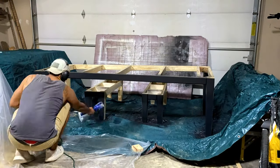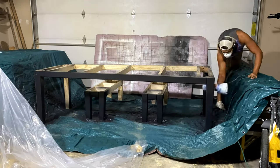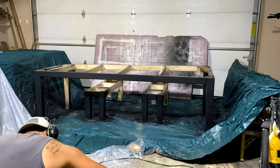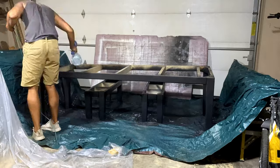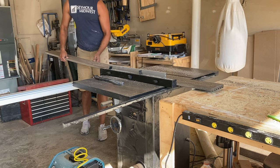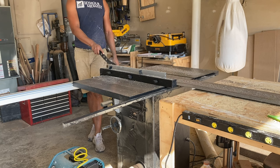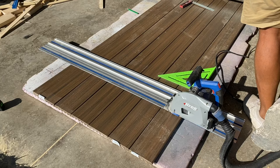We decided to go with a black exterior-rated paint for the base of both the benches and the table. I was a little concerned while milling the lumber — since this is treated lumber, the treatment only penetrates so deep, and I wasn't sure I was removing all of that treated protection as I milled. My hope is that adding this exterior-rated black paint serves as another layer of protection against rot. Worst case, I build a new base and apron — those components were only about 36 bucks.